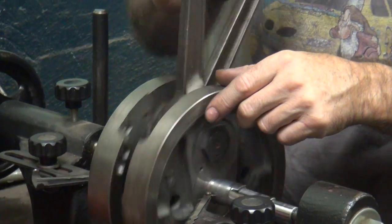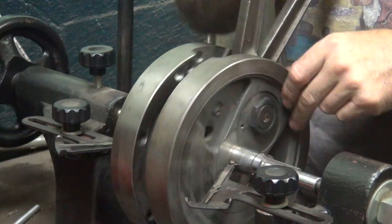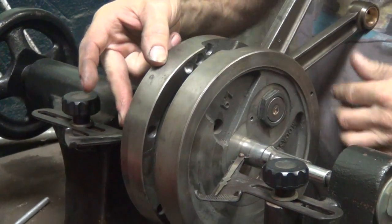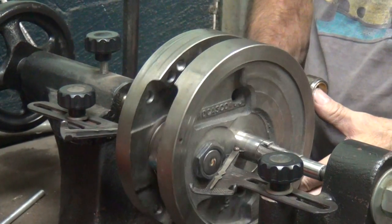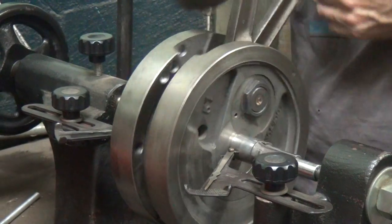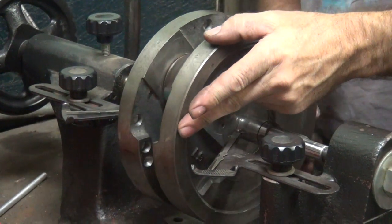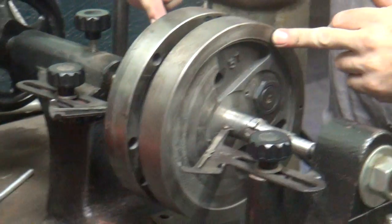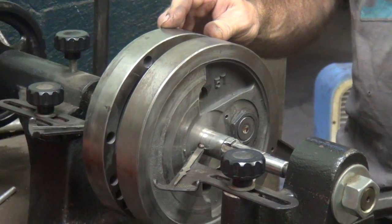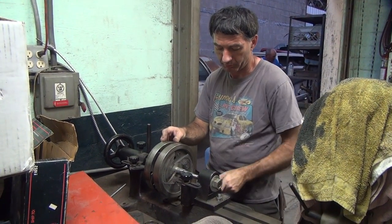This one's high over here. Is it twisted again? No, it's 180 apart — it's a stroke change or taper screw-up now. This one's high right about in here, which is toward the bottom. So you have to twist the crank pin, which is really hard to do, or bend one shaft one way and the other shaft the other way. Pretty much when you get to that point you're done. So let's see if there's anything to do to make it worse — it can always be made worse. High there, high over here. That means this one's still a little higher than this side, which is slightly more than before — so we over-twisted it.